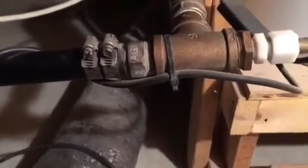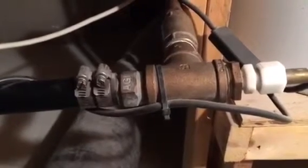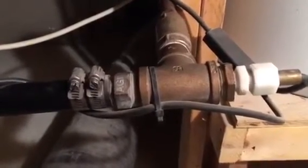I did find out the hard way — I had the sensor attached to a pipe, wire-tied to it, and they tell you once the pipe gets cold enough it will turn on the water line heater. Well, because I had heat in my basement, the water line heater wasn't turning on even though the sensor was attached to the pipe. I found that out when I tried to turn on the water and there was nothing. As soon as I put the sensor in a can of cold water it immediately turned on, and about three minutes later the water line de-thawed.